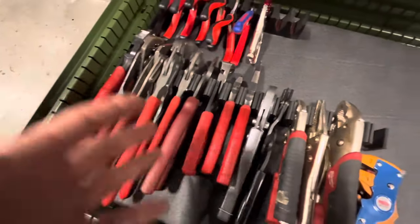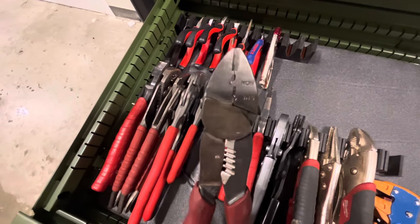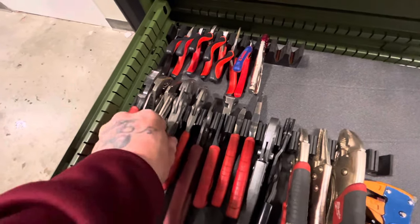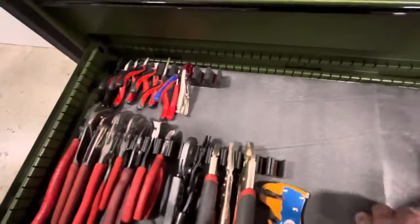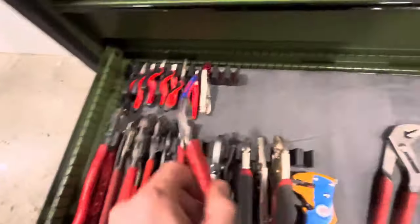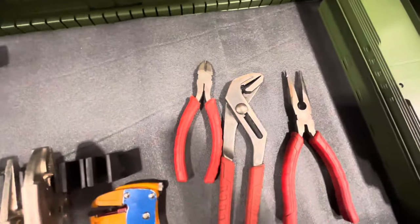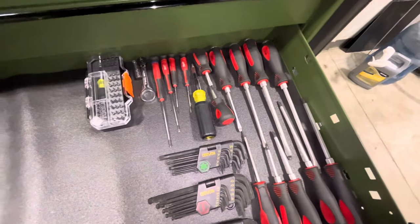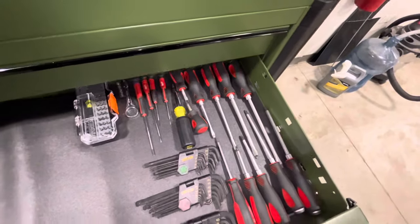Next is going to be pliers. You don't need every single pair. Some wire strippers and crimpers for electrical connections is going to be very important — probably the most important ones you'll need. Your basic pliers — most sets will come with your basics: needle nose, slip joint pliers, some cutters. It doesn't need to be a high-end brand when it comes to pliers if you're planning on just doing some DIY stuff. Don't forget your basic screwdrivers — the multibit driver is great, but having regular screwdrivers is also beneficial.